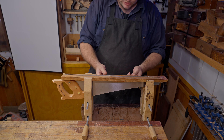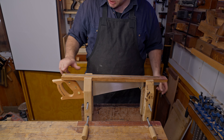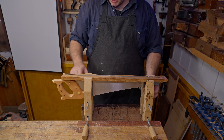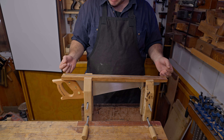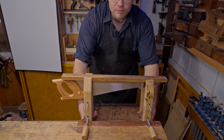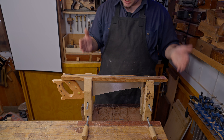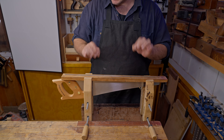What I've got here is a piece of wood with a straight saw line cut down the middle, still attached at one end. To make it more practical than putting it in your face vise, which can be a bit of a pain, I've clamped these two wooden screw clamps into the vise, kept them dead straight so the wood can settle level and we can keep the saw as level as possible.